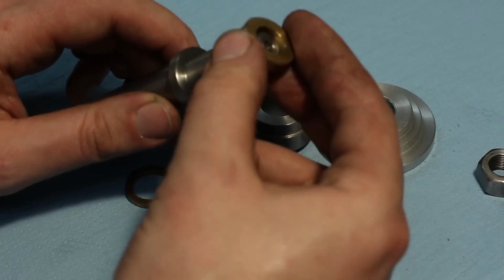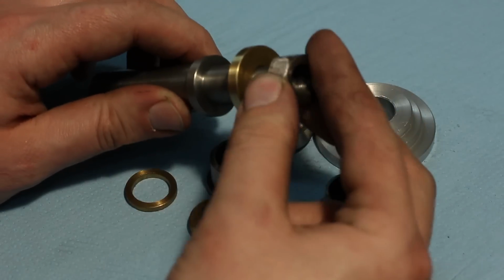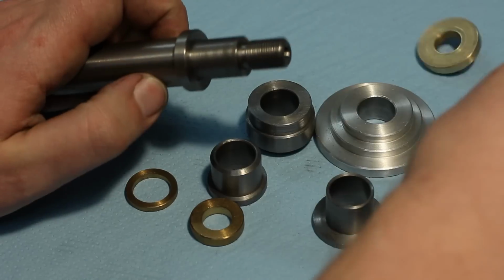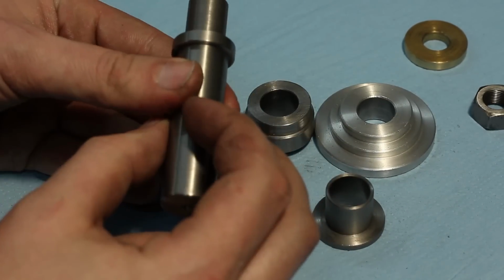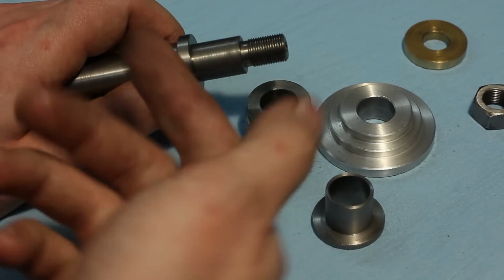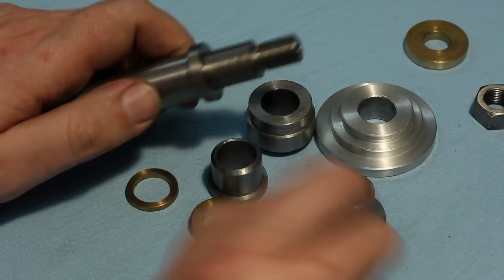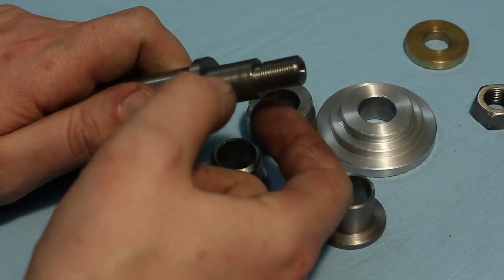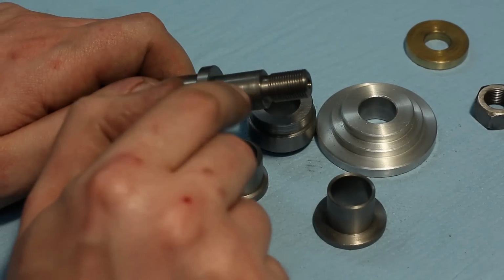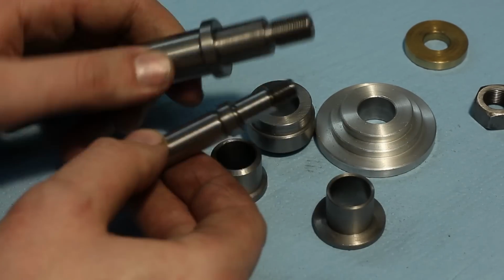And there's also a set of heavy brass washers to protect the part from the clamping nut when you press everything together. And you can either hold it in a chuck or in a collet, or you can hold it between centers if you have to do multiple setups back and forth. So this thing has proven quite useful, but 16mm is quite a big diameter, and for the longest time I wanted to make one for smaller diameter, like 10mm.